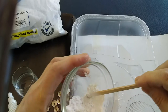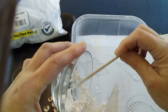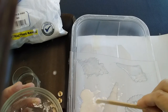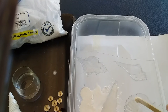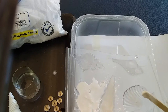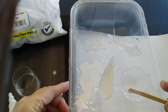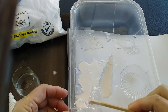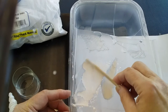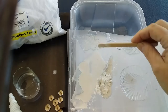I'm just going to scrape in some of the plaster to fill it up. Then I want to tap the mold so it starts to settle. You can see I've got quite a lot of water there, so I'm going to gently tip the mold forward so that excess water drains into the container below — that way I'm mixing up the right quantities. It's not a good idea to have your plaster mold filled completely to the top because you get raggedy edges, so I just scrape a stick over the surface to make sure it's completely flat.